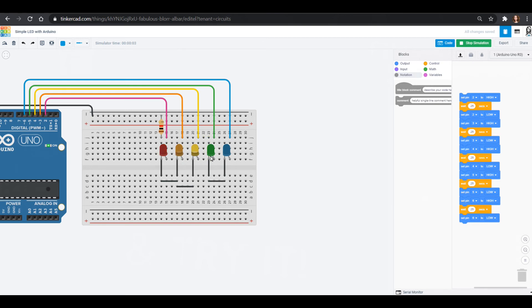We can see what this looks like in the simulation. It looks like our green and blue don't light up, so let's pause. That's because the grounds aren't connected — green and yellow are not connected. So let's add a new wire. We skipped that one by accident. Now let's start the simulation again — there we go.